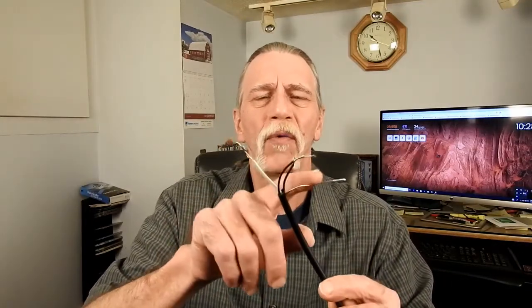I'll be replacing the lamp cord as well as the long extension cord that runs along the wall next to me. The replacement cord I will be using is called MuCord. This product is exclusive to lessemf.com. It claims to suppress both the electrical and magnetic fields. It has two 20 gauge hot wires, two 20 gauge neutral wires, a ground wire, and metal sheathing surrounding the wires under the insulation. You twist the two hots together and the two whites together. Then you can wire them normally on each end.